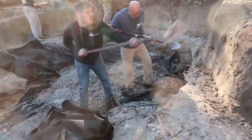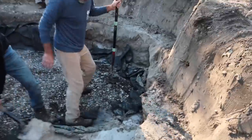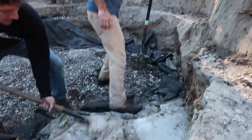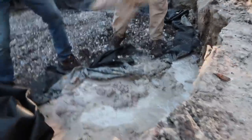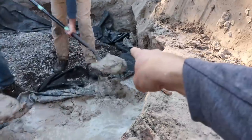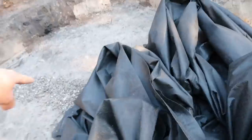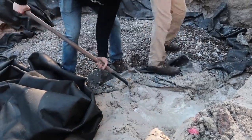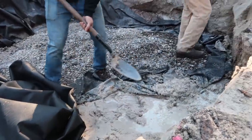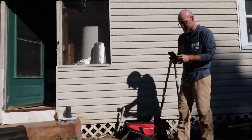This is what progress looks like getting the infrastructure underneath the pond complete. We're creating a much more solid base that'll be underneath the liner. We've got our drain tile running from that corner, going into a T which also has a four-inch line running in a trough this way underneath. We put fabric down, then the drain pipe, then three-quarter clean stone over the top of everything, then more fabric over that, then our liner.